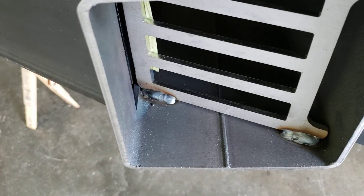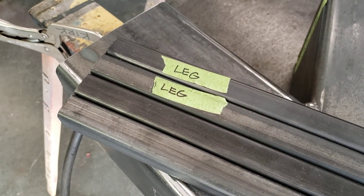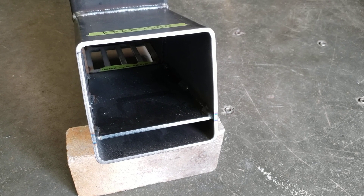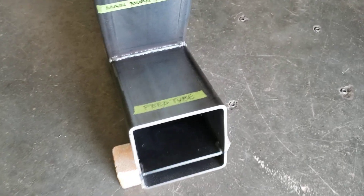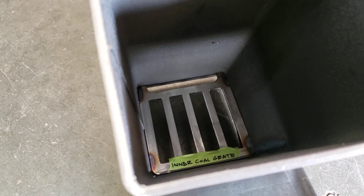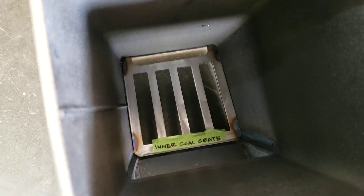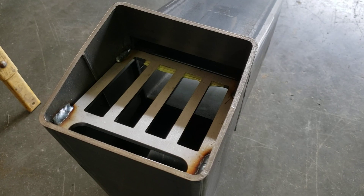Here's one side welded — you can see I have roughly an inch of weld at each one of those corners. The legs used as temporary spacers have been removed. When you have your grate welded in it should look something like this, and the little notch in the back of the stainless coal grate is to facilitate easier cleaning. When you slide your ash slide open it keeps the ash from clogging up in there.